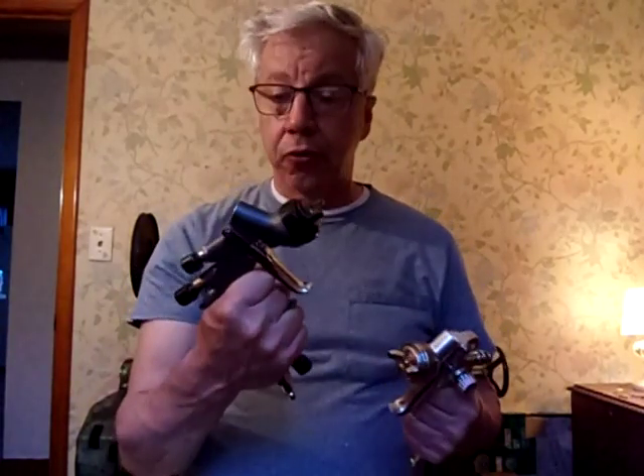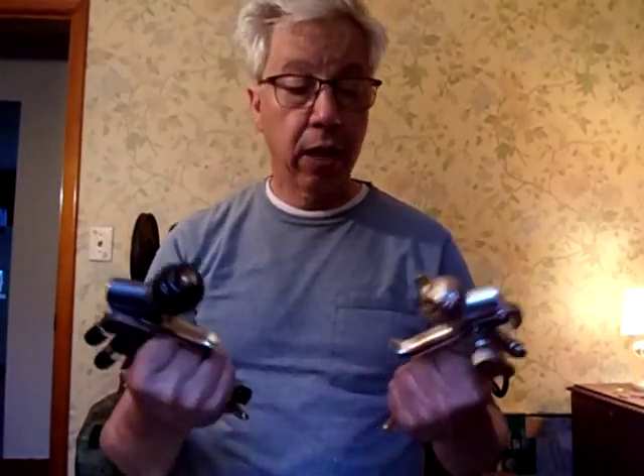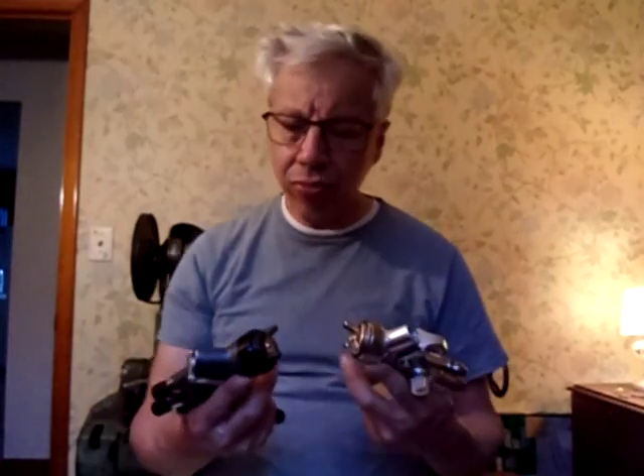So I'm talking about the RF2103 and comparing it to the Vivore. Quality is just about equal — both excellent, much better than cheaper guns. The spraying is different: the Vivore fans out better, making a skinnier, taller fan, while this gun makes a fatter, football-shaped fan. The RF2103 seems to use more air but doesn't fan out as strongly. I'm guessing the guns may bias air differently — toward fan spread versus atomization — but I'm not sure on that.